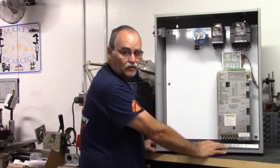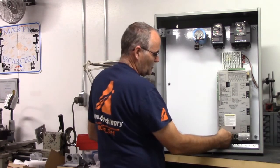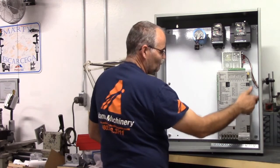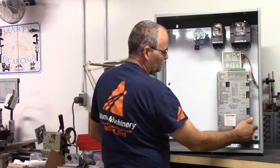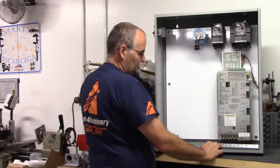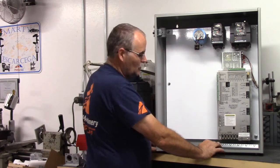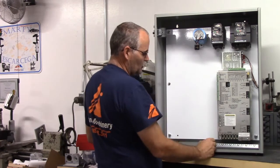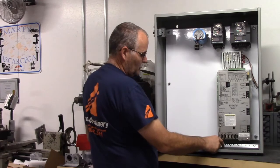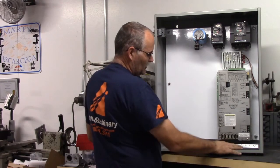I've got a strain relief here mounted so that my cables can come in, and then the encoder cables can plug right into all-in-one DC. Motor cables can come up here and get landed on their respective axes terminal blocks. And then over here, any of the limit switches can come up this way and land into their respective spots. And lube pump and coolant pump, we can probably get them squeezed in on this left side of the strain relief, the cabinet strain relief.